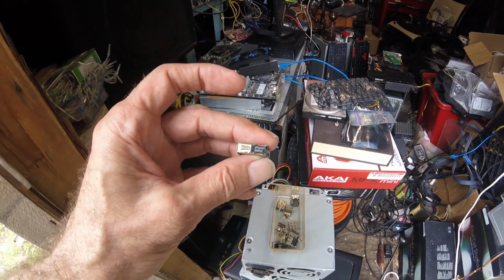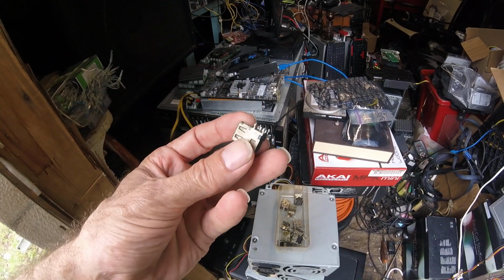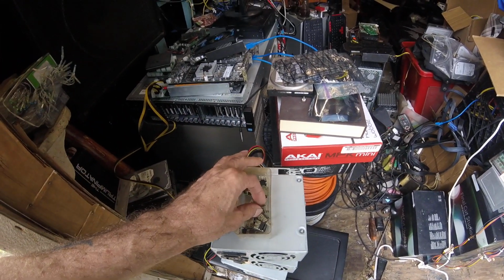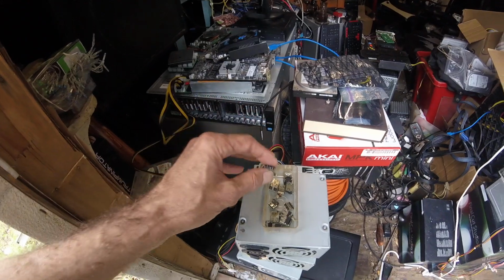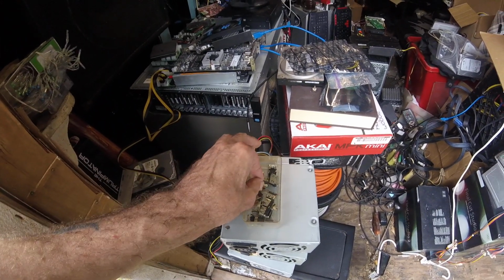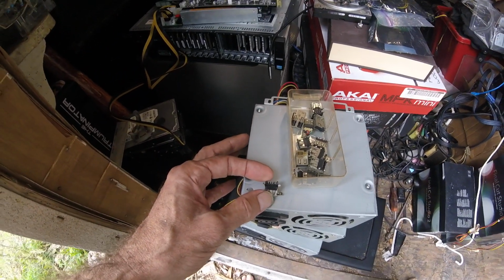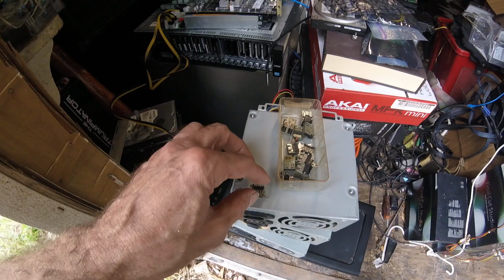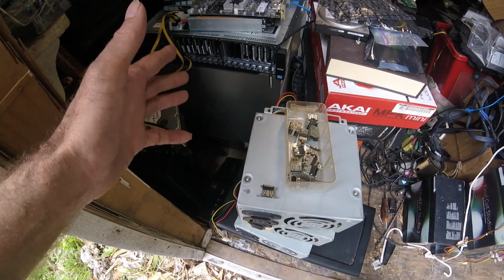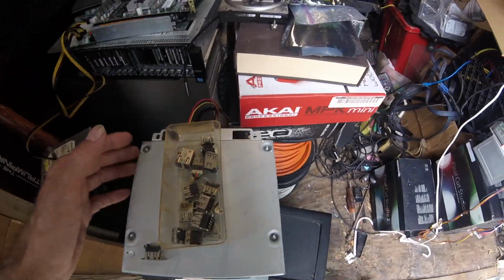And you got 4 pins on the back of these plugs. If you're wondering where I got mine, I save them from the back of a dead laptop or something. I really don't buy them, I don't have to, there's too many. Basically, your outside 2 wires are power, and your 2 centers you're not going to need because they're just data, and all he wants to do is provide charging ability.